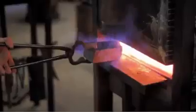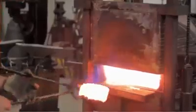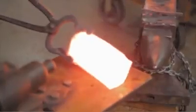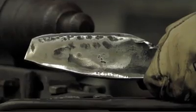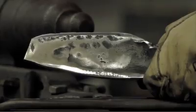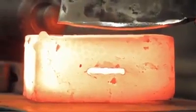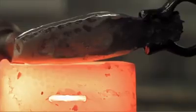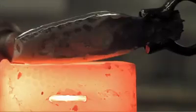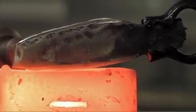A new block of steel is heated to roughly 800 degrees Fahrenheit and will be used to spot heat and to form the knife once again. Meanwhile, the knife is being sanded down to remove as much of the oil from the surface to reveal the shiny new steel underneath. Tempering relaxes the molecules again, but not nearly as much as annealing does. It keeps the piece from being too brittle. After this, it will be just right, not too hard, not too soft.